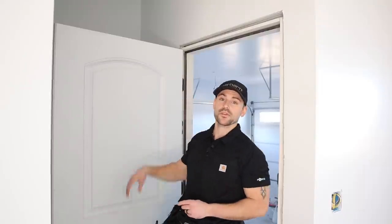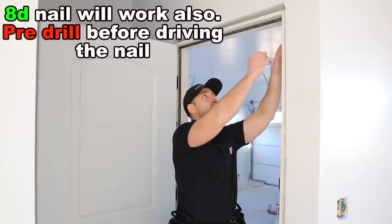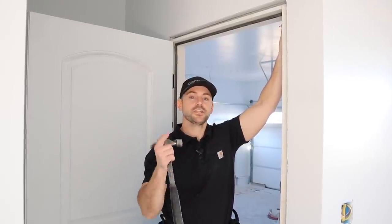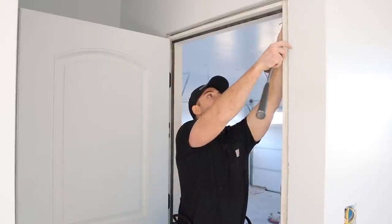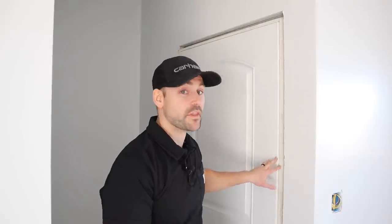The screw is holding the door, so now we just have to make sure it's plumb and check the reveal. With a screw in the top hinge, the door slab side isn't going anywhere. We need to go to the top corner of the latch side and anchor it flush with the drywall using a finish nail. I'd typically use my finish nailer but I lent it to my brother. Get it flush, drive the nail in, then use a punch to finish driving it all the way. Checking the reveal — the door is set exactly where it needs to be.